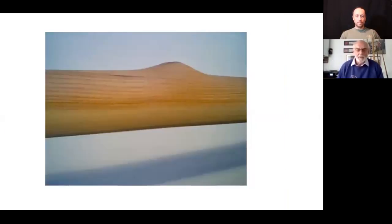Where you've got a knot, and this is a fairly small pin knot, it's usual to raise the wood around the knot to strengthen it, to stop the wood actually fracturing at that particular place.